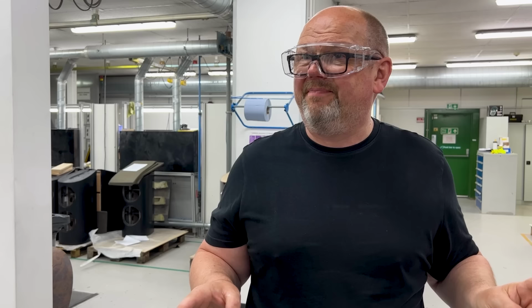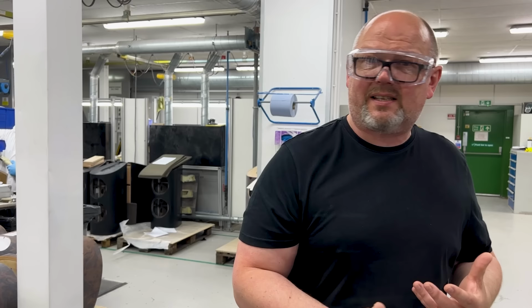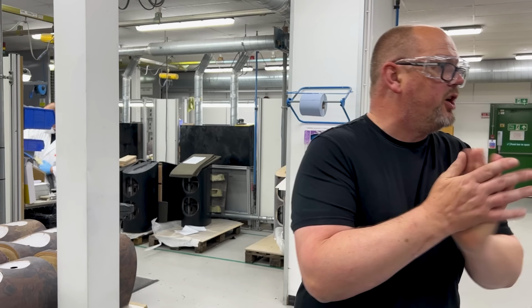A painted or high gloss cabinet will be in here at least twice. It will be painted, sanded first to get it smooth. Then it will receive its five coats of base. Now the base paint that we put on is of a thicker composition, which gives us the necessary depth and toughness. When it dries with a somewhat imperfect finish, which looks a little bit like the surface of an orange peel. And we can't have that.